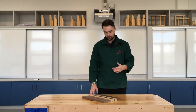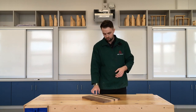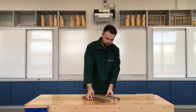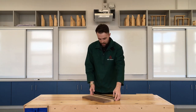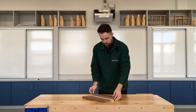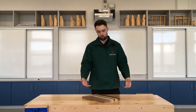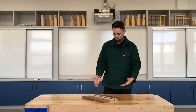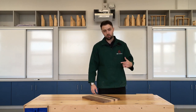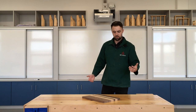Now we're going to jump back to the planer and thicknesser. I'll do some surface planing on some of the edges because I don't like how they fit together, and then for the sides I'm 100% sure about I'll run the other side through the thicknesser. You'll see that probably in some sort of time-lapse and when we're back over here we'll be ready to glue up. It already just looks really nice - nice contrast, nice big board.